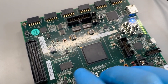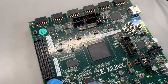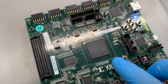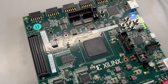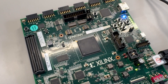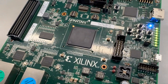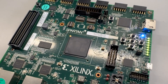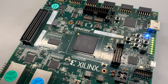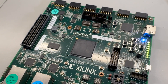Once that's done, I can attach only the CPU and maybe some SRAM until I do the migration to FPGA itself, or MicroBlaze, or even better a RISC-V core, which is completely open source. As someone mentioned, MicroBlaze itself is not the best approach because it's limited to Xilinx parts. So maybe in the future, some sort of open-source ARM core, or even better, RISC-V will do the job best.